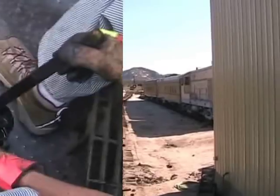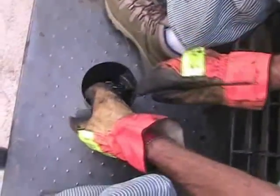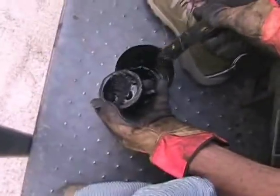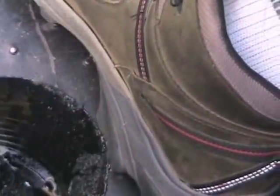This is the number one, and it's always the worst. You know, today it's full. There's quite a bit of carbon in the bottom. Now, the reason the oil gets in here, as I understand it, is because we run the engine so slow, and they never get really hot. It doesn't burn off.